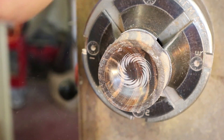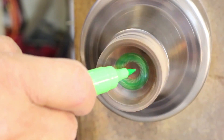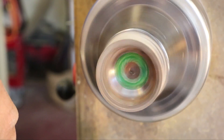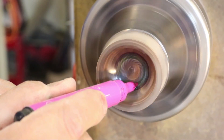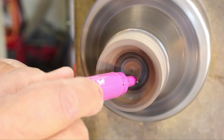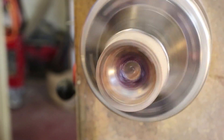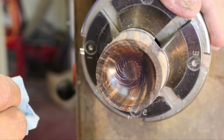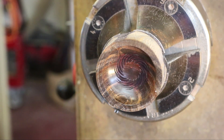One of the things I'll do next is add a little color to the texture. It's important to add the color right now, and later I'll put a friction polish on top — otherwise you'll just erase all the color you put on. I like that because it really highlights the texture. It's very important to finish the inside of that lid completely before I do any thread chasing on it, so it's completely finished except for the thread chasing.